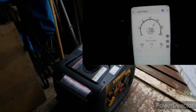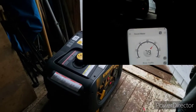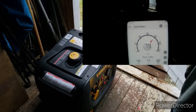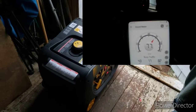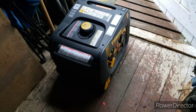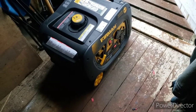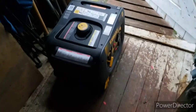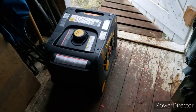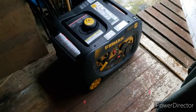It's on eco mode right now because I'm going to run it for an hour on eco mode at the lowest setting. I'm putting in 0.7 of a liter of fuel, so that should give me about an hour — 700 mils. The shed is on a little bit of a slope, so maybe it's not getting good carburetor flow, but maybe I should take it off eco mode. We'll come back in an hour. It took a little bit to get it going — hold the choke and give her a few pulls, then close it and keep doing that until it catches.